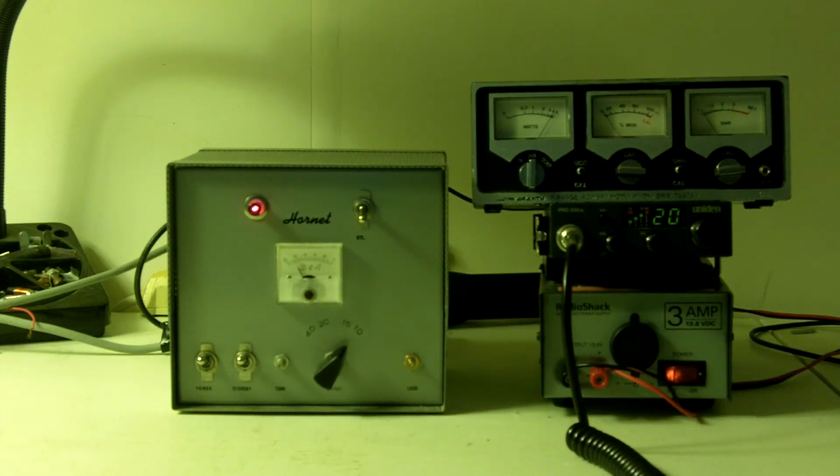The receive preamp, the BTL switch on most of these, the receive preamp on the D&As tend to go out. There's really nothing protecting the transistor from RF spiking and blowing it. So even though it's easy to fix, it tends to blow again. But it's not really a bad little amp. As CB amps go, this is actually a fairly clean little amp.